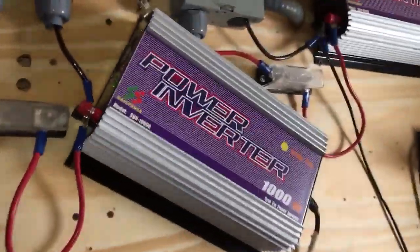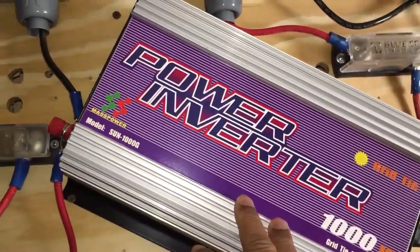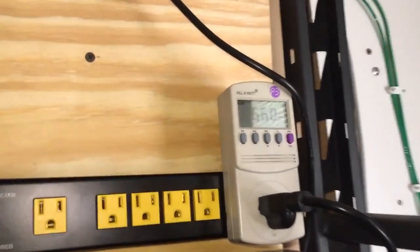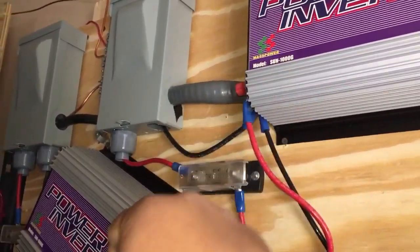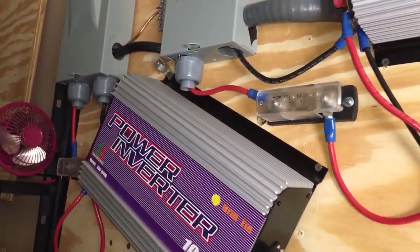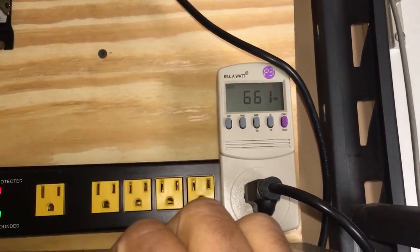I have 1000 watts of solar on this grid-tie and another 1000 watts on this grid-tie. So far this one is still at 660 watts. These two grid-tie inverters are cheap but they work — I'm going to either get a Sunny Boy or maybe an Outback grid-tie inverter to replace these. They're not as efficient but these have gotten up to 980 watts at one point.